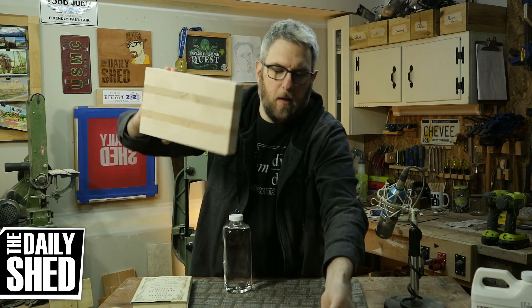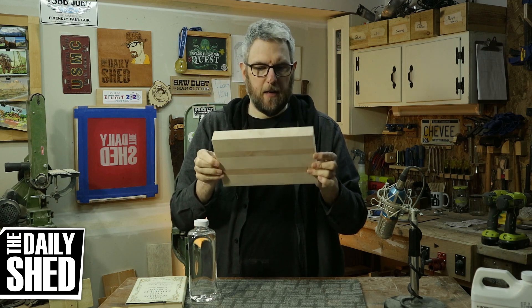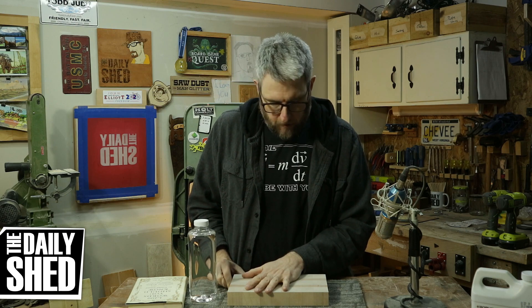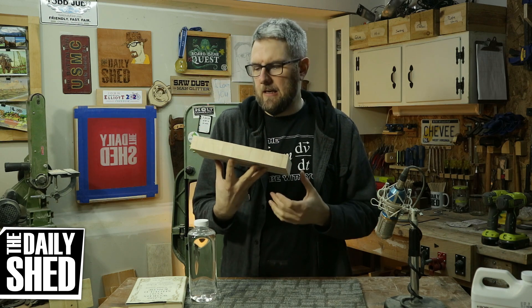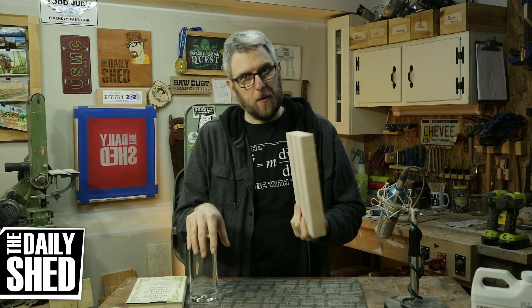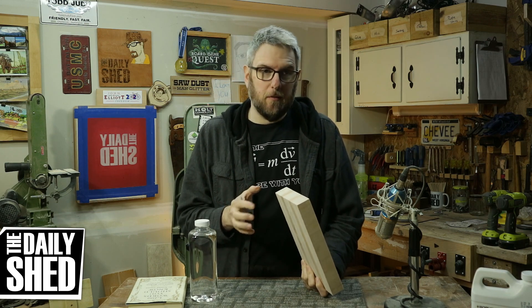I've got a tiny cutting board here that I made recently for myself. I'm not sure what I'll use it for because it's basically too small, but I had never really made an end-grain cutting board before so I wanted to try it. The experiment went well — no huge gaps or anything. I wasn't even aware that you could put drying oils on a cutting board. I've always used mineral oil — just mineral oil and maybe some beeswax. But mineral oil just leeches out, and on an end-grain board the straws going this way means it'll eventually leach out completely. I've also discovered that some people use tung oil on cutting boards and it's perfectly safe.